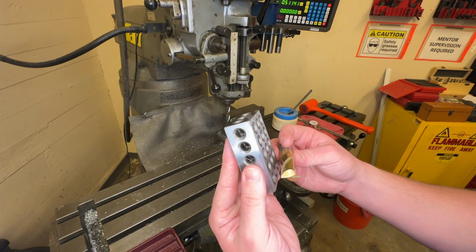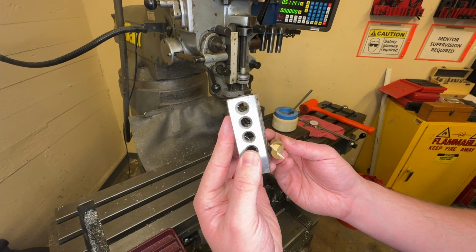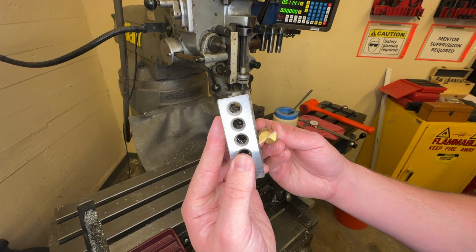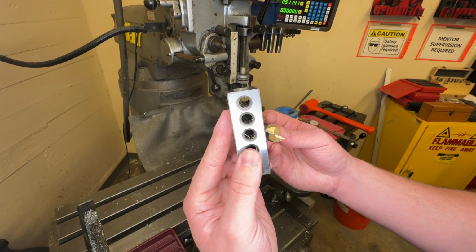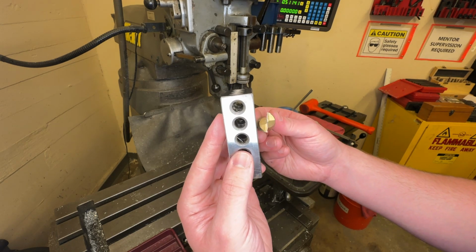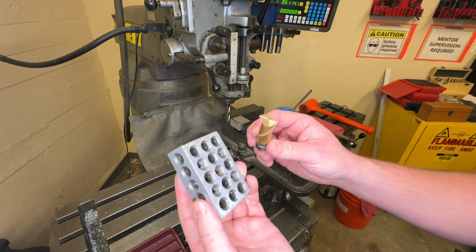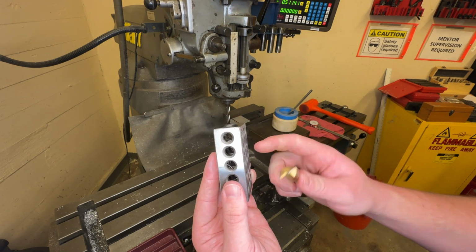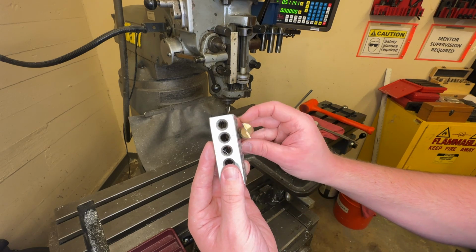Now the opposite of that, the tool is still spinning this direction. The tool always spins this direction, but now I'm traveling upward. So now every time I spin, it wants to pull the whole part up this way, or actually down this way. So tool stays still and the part wants to move. That's going to cause a lot of pull on the machine, and we don't always want that. Climb cutting does create a better surface finish like this. So it'll be a little smoother on the side, but better for the machine is to conventional cut.